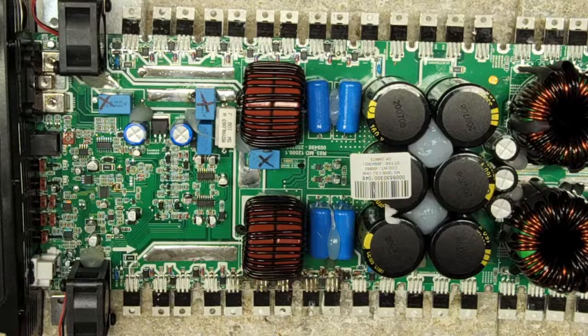Did you find a buffer IC shorted between pin 1, 2, and 3? Oh, you did. Go ahead and replace the 2957. May have caused damage to it. Oh, yes. So you had a failed buffer with no shorted transistors? That would be a very rare occurrence if that happened.